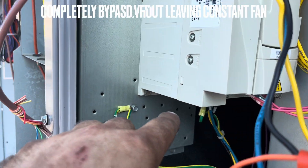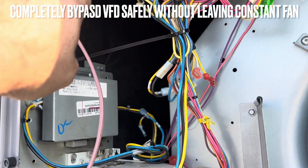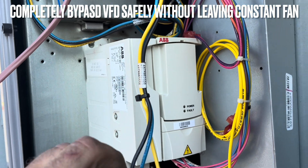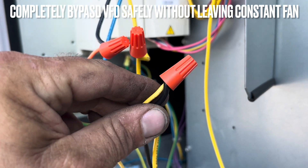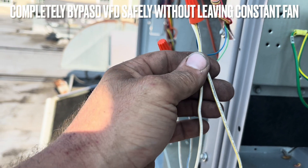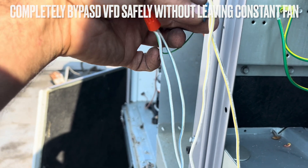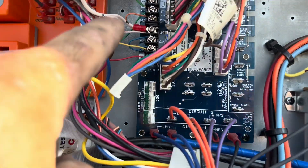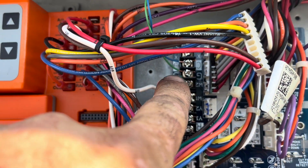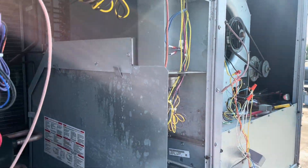For the bigger picture: you're bypassing your entire VFD. You're taking your top wires coming in from up here — that's your normally open, wired direct — and then your black wire gets your common. On the low-voltage side, you have your common coming into your yellow and G, which is your yellow and blue. Then you take the thermostat wire all the way back and wire it into your common and G.